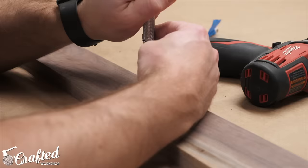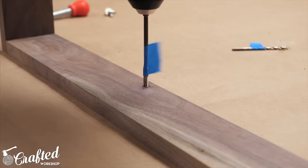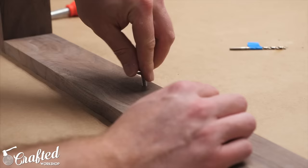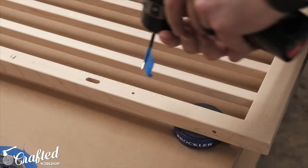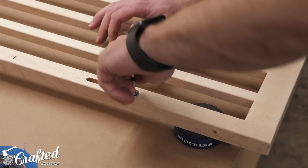After the glue dried I marked the locations of the tapped holes using the head and foot boards for reference. After marking the holes I used a center punch to keep the bit from wandering and then pre-drilled the holes. To tap the holes I used the Wood Whisperer thread taps, which I've used in the past with a lot of success — these threads are incredibly strong and are super simple to tap. I used a piece of painter's tape to mark the depth and then just ran the tap in and out using a drill. While I had the tap chucked in my drill, I went ahead and tapped the other holes on the head and foot boards as well.